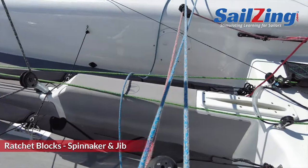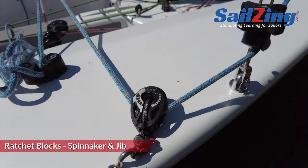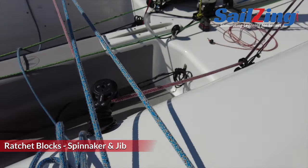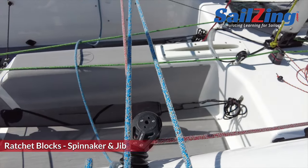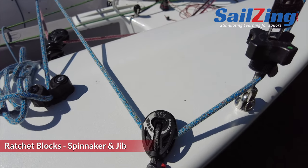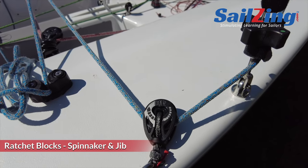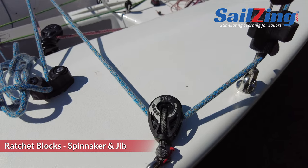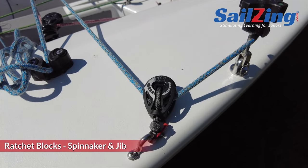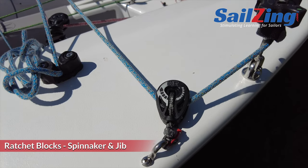If you've got ratchet blocks, such as what we have here, these are the upgraded Harken ratchet outsides for the spinnaker, and these are for the jib, you need to make sure that it ratchets in the proper way. It should resist you when you let it out. It should not resist as you're pulling in. And with these auto ratchets, they won't actually feel like they're grabbing until you have some pressure on them. So you have to make sure you put a little pressure against the block to cause it to give that ratcheting feeling so that you know you're going in the proper direction.